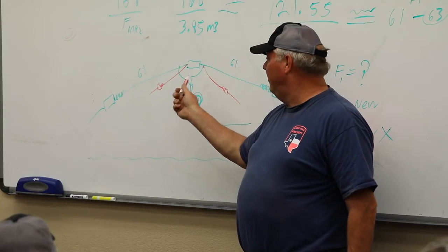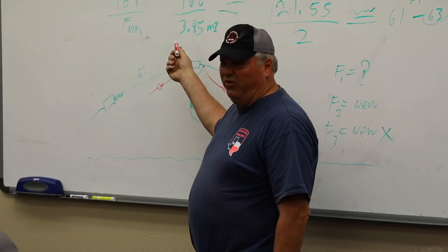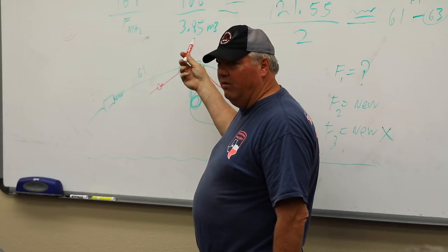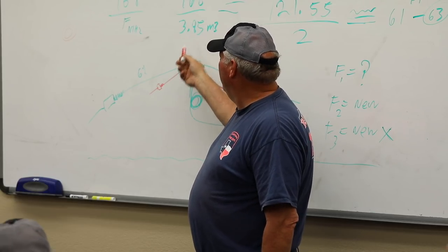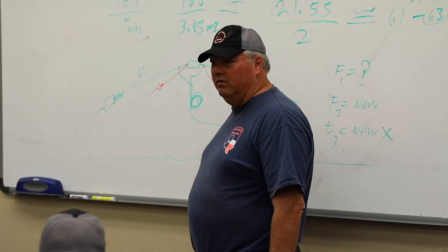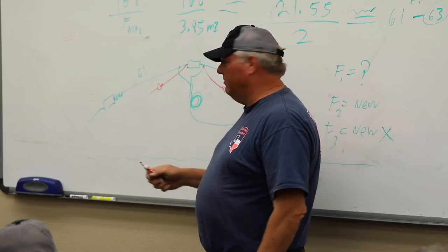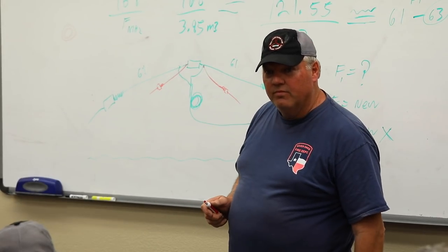If I go to 40 meters and I make this resonant, what if I just doubled that frequency or close to it, right? To get my center point and tune, which would be too high, by the way. It'd be 3,500, so it'd be a little too high. But it'd be really, really close, wouldn't it? It'd be within a window that we could use. So how do you select the 40 over the 80?